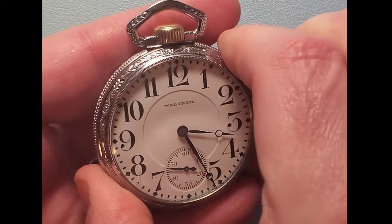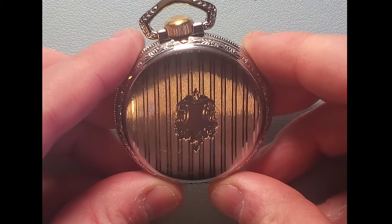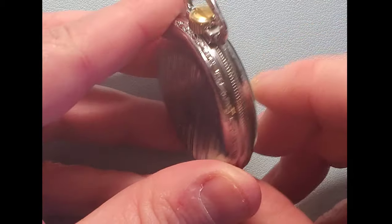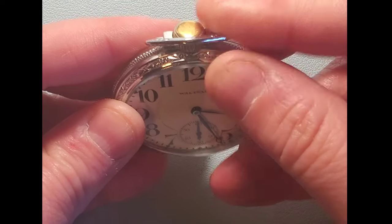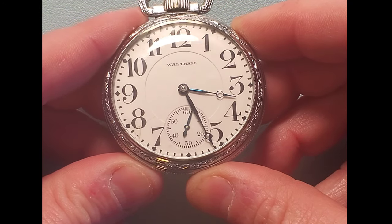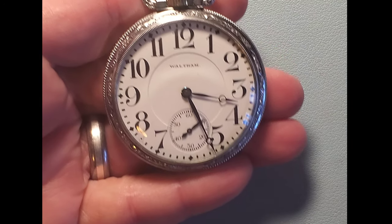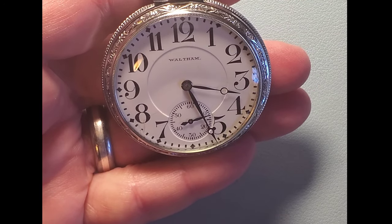I've had a pretty amazing improvement from where it was when I started — down from 20 minutes fast to about three seconds a day fast. It's reasonable to ask why the watch was running so fast to begin with. There really wasn't just one cause — it was a number of things. It was a watch past due for service that needed to be cleaned and re-oiled. It was also the large beat error, I think, that had something to do with it, and the fact that the balance was out of flat and even touching the balance cock at points. All those issues have been dealt with, and we have a completed watch ready to go back to the owner. I'd like to thank you all for tuning into my channel — this is Red Vitus, and I hope to see you again.